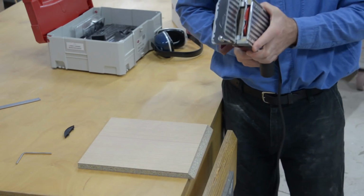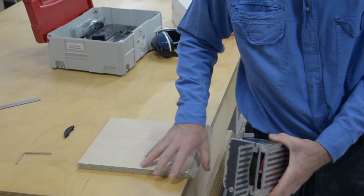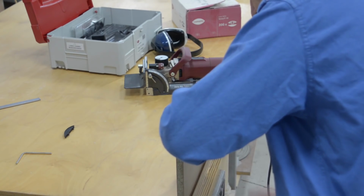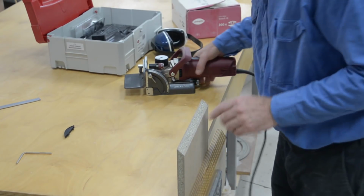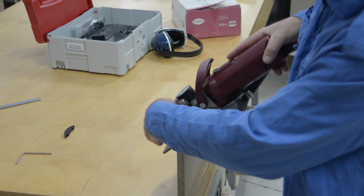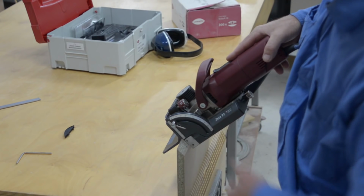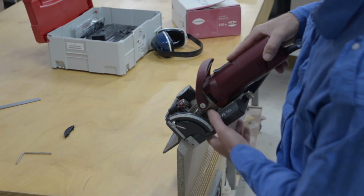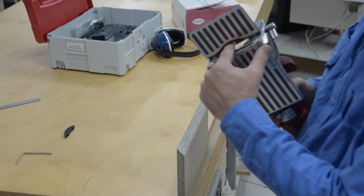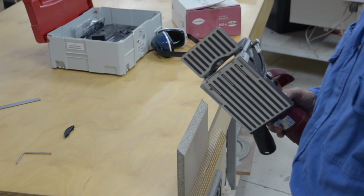Now, the only downside of all of this is you have to, where are we? You have to make sure that when the cutter comes through referring to the outside, I'll put this in the vise, it'll give me something to roll. You need to be very careful that when you are using the outside of the miter, you're not going to be driving the machine through here and coming out the other side. So you do have to pay attention. I mean, that's a given in any situation. That you have to make sure the cutter's not going to go through your board. But here you may also, if you're doing something a bit silly, actually hit this part here. It is scalloped out, obviously, to give you some latitude, so you're unlikely to hit it, but nonetheless it's something you need to pay attention to if you're using the machine.